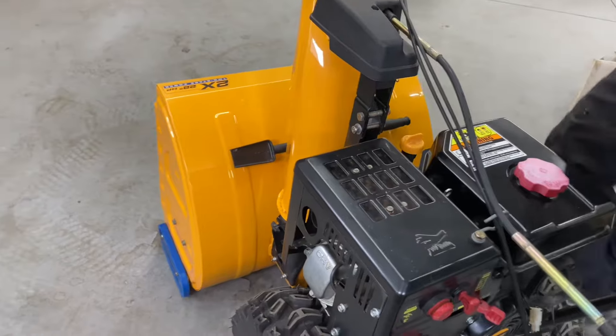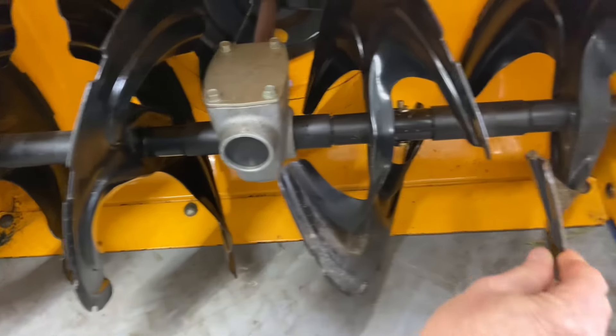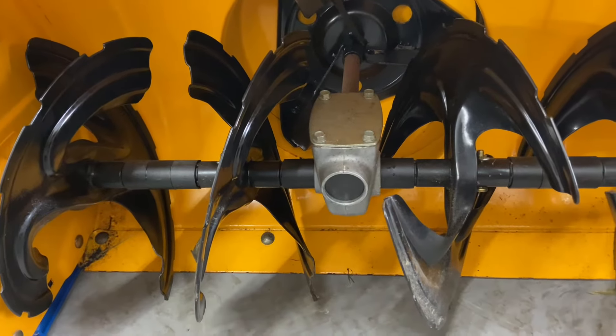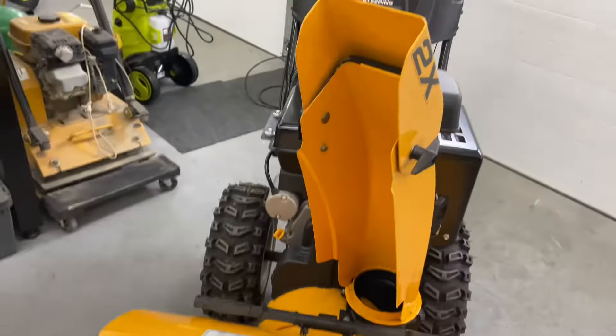A couple of pointers and tips. When you get to the front of your machine, if you ever start blowing snow and it doesn't seem like it's blowing very well, that's why I showed you the shear pins — you have a shear pin here, one over here, and one here and one here. The newer-style snowblowers have a lot of shear pins that can be sheared. To check if your shear pins are working, just move your augers, each individual one — make sure they don't spin freely. If they spin freely, you have a broken shear pin. Pop out the old shear pin, put a new one in, and away you go. Also, a really good thing to use is heavy-duty silicone spray — spray it in here and around your chute before you go out and blow snow. It'll have a no-stick contact, so the snow will come in and go out much easier. In heavy snow, it helps a lot.